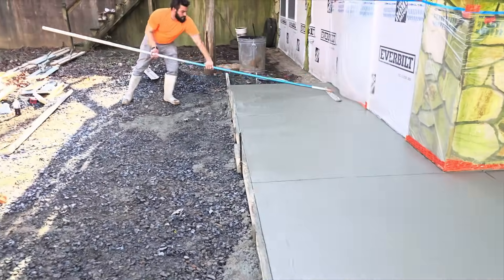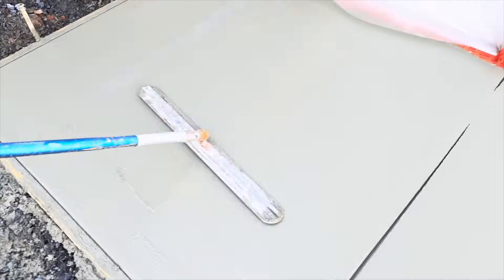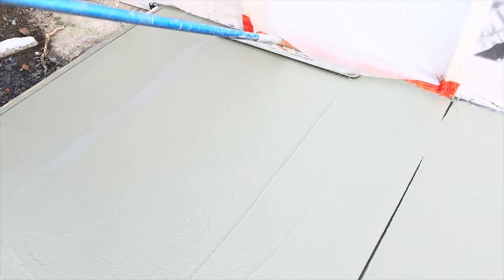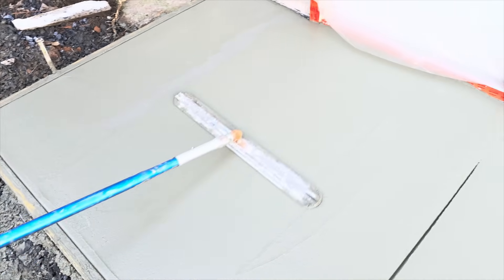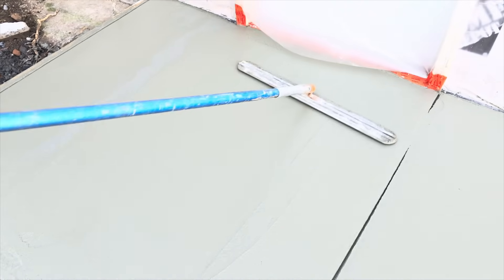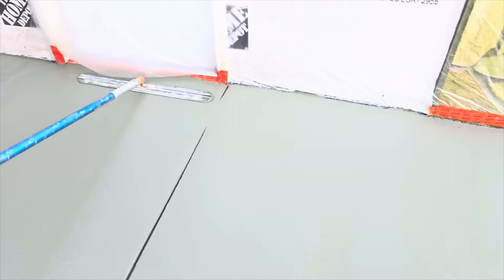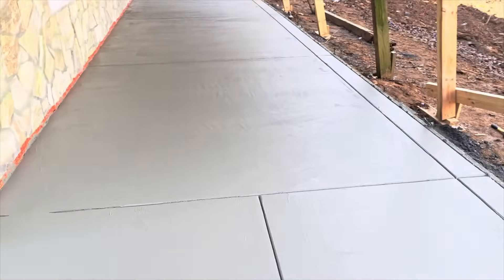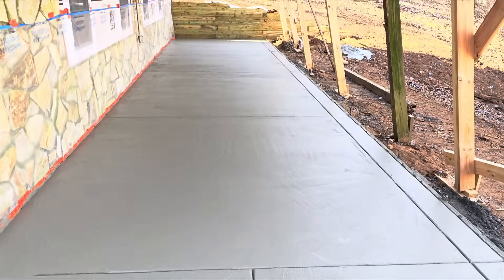The slicker is a really cool tool once you get the hang of it. It's three feet, hard and rigid just like a mag, so it fills in imperfections and low spots. It does not lie or flex like a trowel does. I like to put that on after the bull float. Sometimes we'll run a fresno or funny trowel, but you could see this was tightening up on us — we'll get that out and show you how it turns out.